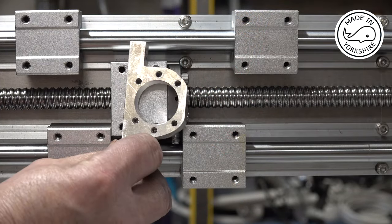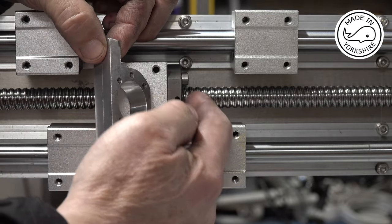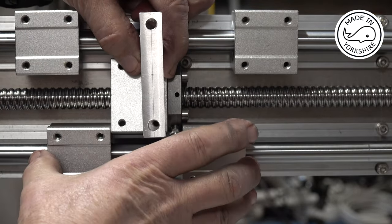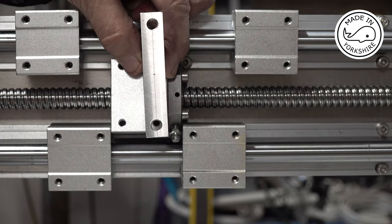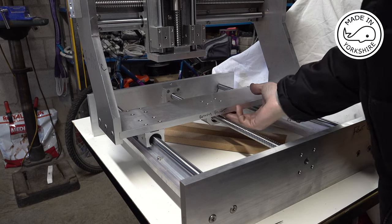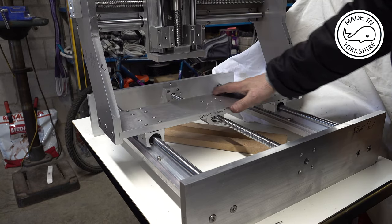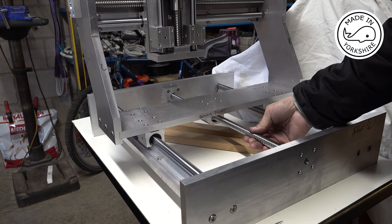That's the connector made - it's just a matter of taking that off and bolting it onto the ball screw nut like that. That should allow these to come in a lot closer, so I'll take it apart, reassemble it, and get back to you. Well, I'm absolutely amazed how well this has gone together. I fitted that first and then bolted this down, and it seems to work very freely - I'm happy with the Y-axis.